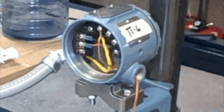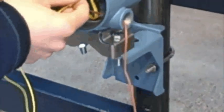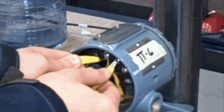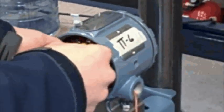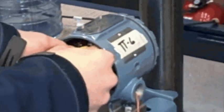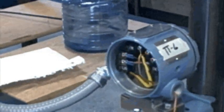Let's short it out real quick and see if it's even getting a signal. So you're shorting out the thermocouple? Shorting it out to see if we can get ambient temperature. No change... 71 degrees — room temperature. So as soon as you shorted the input, we're at 71.